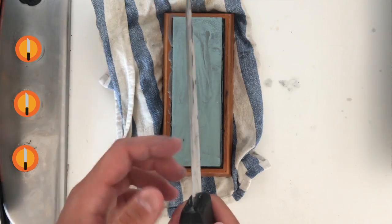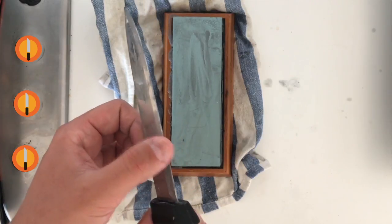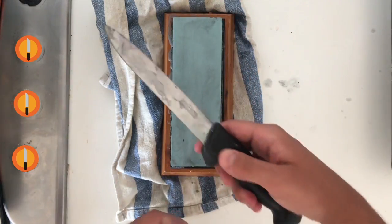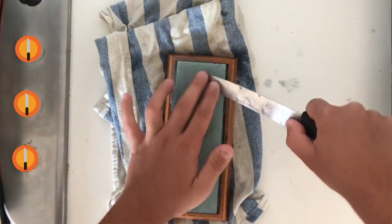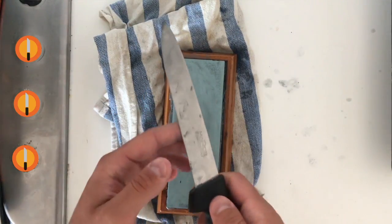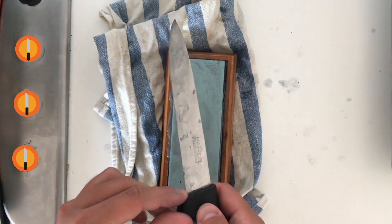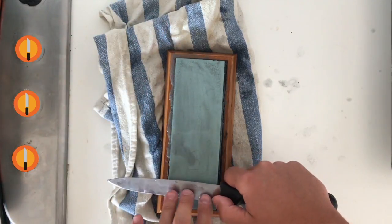The opposite sensation is if you feel the side that you're currently sharpening, because this side is gonna be perfectly smooth. Decide to go on and sharpen the same side for like another minute or so. Because what happens sometimes is that you feel for the burr here, but then you don't feel it here, and you want a burr along the whole length of the blade.